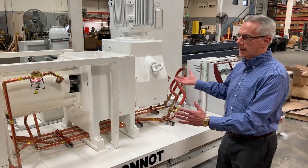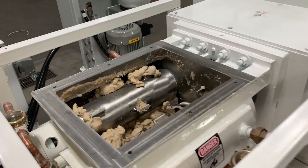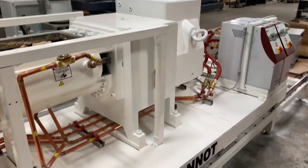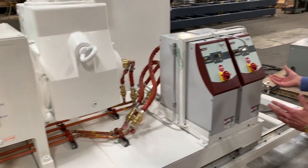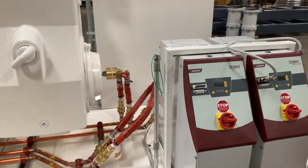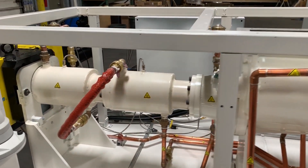The system is comprised of our twin packer technology with exclusive feeding with the two counter-rotating packers. It's integrated with temperature control through these two TCU units. As you can see, they're plumbed to not only the screw for temperature control, but also we have a jacketed hopper and two barrel sections, fully plumbed.